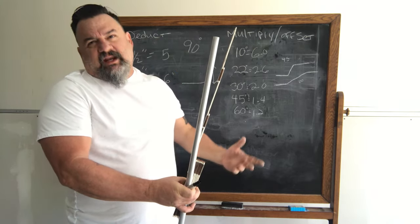I put the bender arrow at that mark, pull it up, and I'll be right on the money. I'm doing this upside down — I've been doing it so long I can do it that way. The bender goes right on that mark. For a 90 you can't just use any mark like you can with offsets — this specific arrow mark is where you start. Bend it up to 90 degrees, and checking with a straight edge — right on the money: 10-inch 90.